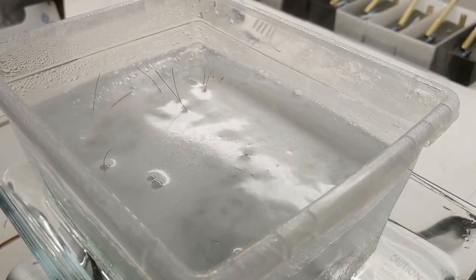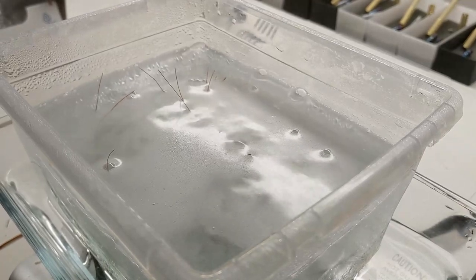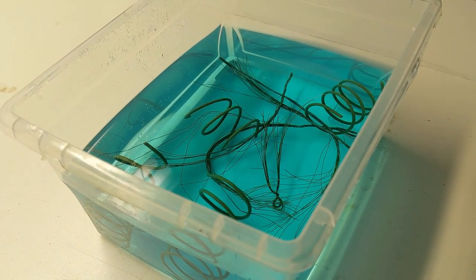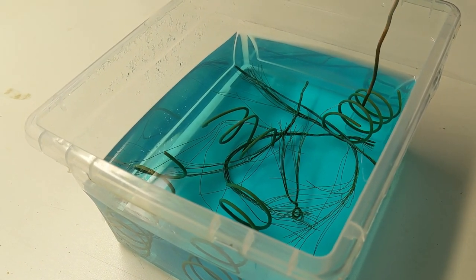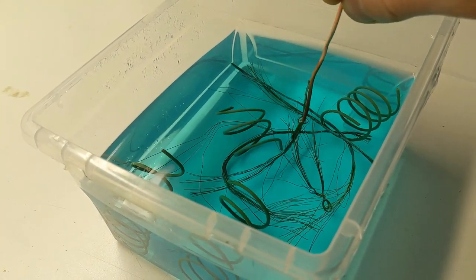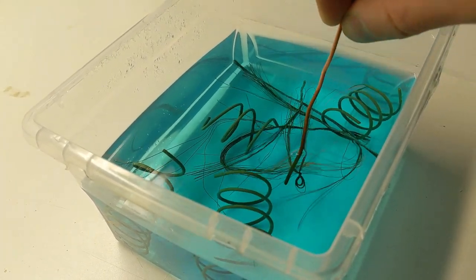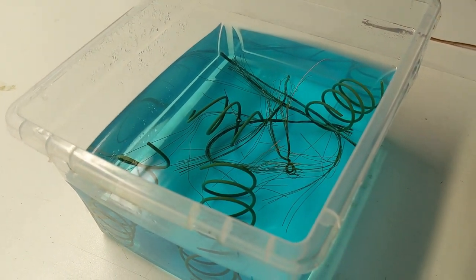Once again, there are lots of tutorials online on how to make copper acetate. In this instance, I actually had concentrated hydrogen peroxide from my float tank days. I had a 30% solution, which is quite potent and dangerous on the fingers. But basically mixing that with vinegar, I'm able to create a solution that super oxidizes copper. I put a bunch of copper into it. The hydrogen peroxide basically helps speed up the reaction, and then the vinegar corrodes the metal and you end up with a copper acetate. You can do it a bunch of different ways as well, but this worked well.